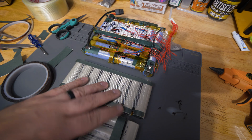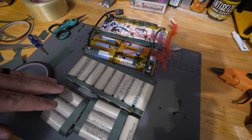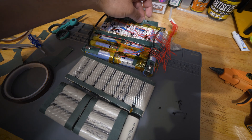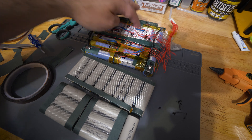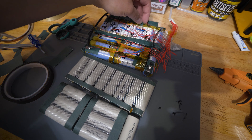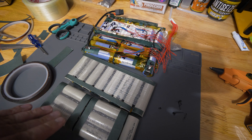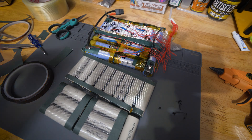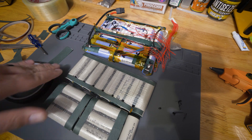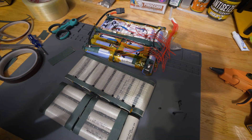Got the cells glued together, fiber tape to hold the packs together, and this loose cell down here. What I've put is fish paper on either end to sit underneath the balance tabs. You really should have something more than nothing under the balance tabs because these are sharp — they're not rounded off, and that might become problematic if it starts piercing into the insulation. Generally what one would do is put fish paper underneath the balance tab in addition to fish paper over the balance tab, so that way nothing contacts the lid of the battery box. Fish paper here, fish paper here, then wrap it up with some Kapton tape to secure the edges.